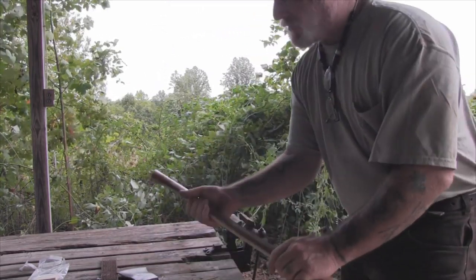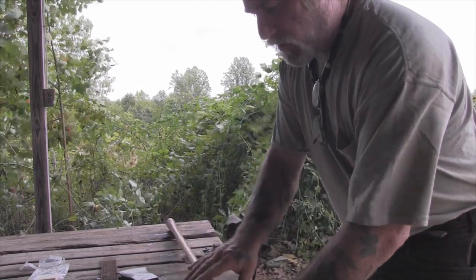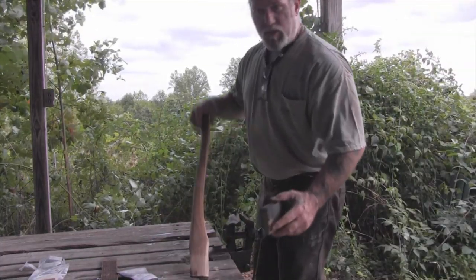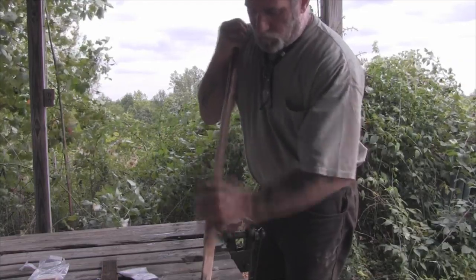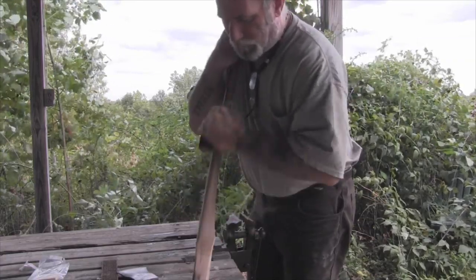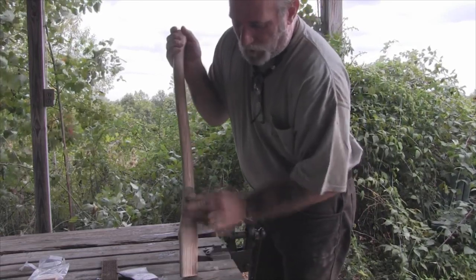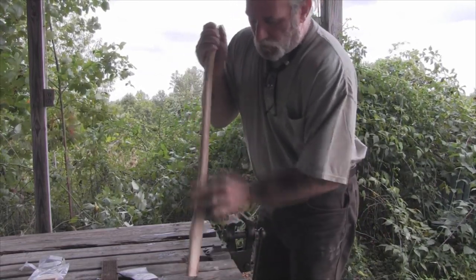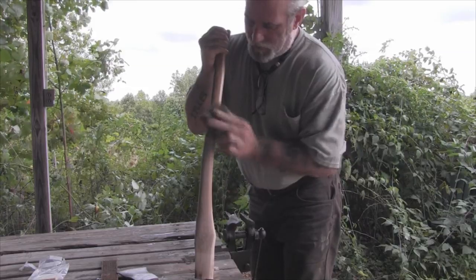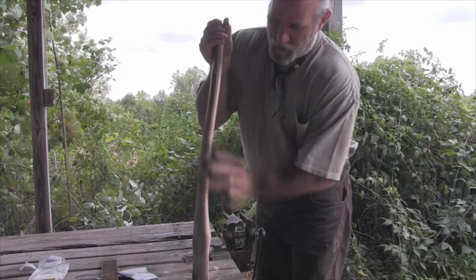We'll use our vise for that. We're going to clamp this into a vise, wrap something around it so we don't mar the handle at all, and carve this down just a little bit with a horseshoe rasp where it needs to go to fit up in this eye. Now one thing I generally do with handles you buy from a hardware store - they generally come shellacked, and I will get that shellac off right off the bat because I want to oil this handle. I don't want to rely on that shellac or varnish to keep it in good condition. So I'll take just a sanding pad - you can buy these at a hardware store, pretty cheap - and get all that varnish off the handle first.